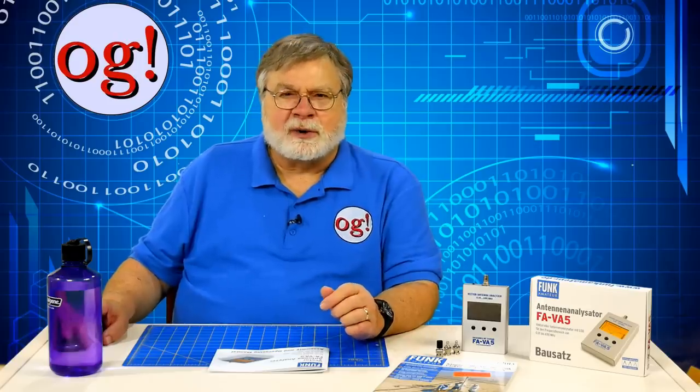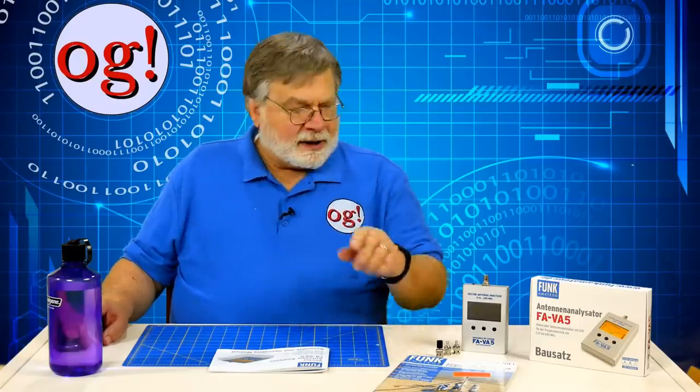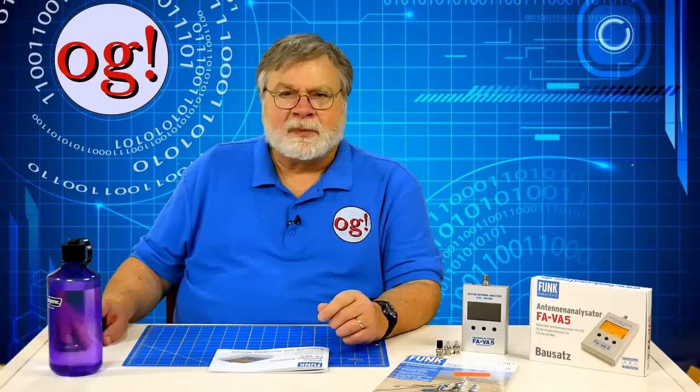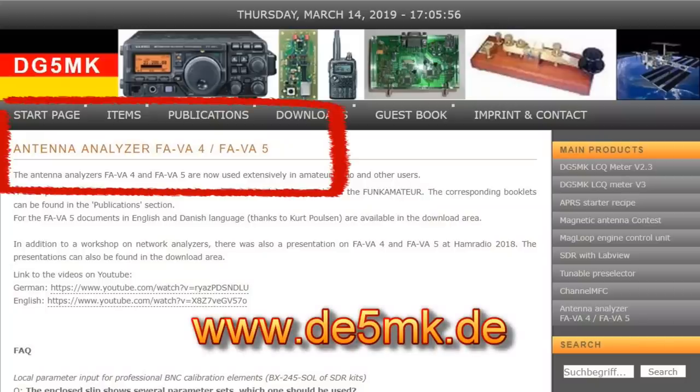After installing the driver that goes with the desktop software, the device manager shows the right driver. I had to use device manager not only to locate the correct COM port — COM6 — but also go into the driver to set the correct baud rate, which was 115200. The software then found the instrument. Note that plugging in the USB cable causes the analyzer to go to USB mode; it also draws power from the USB cable and the on-off switch doesn't work. There is also a page for this instrument at www.dg5mk.de with some documents in German and some in English. Google can translate any page, but remember it is a machine translation — take every word with a grain of salt.